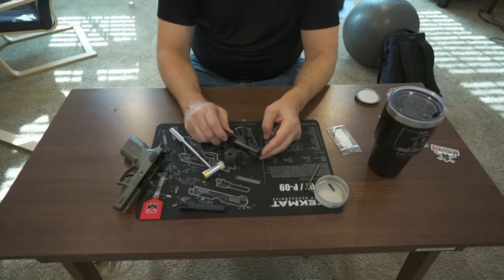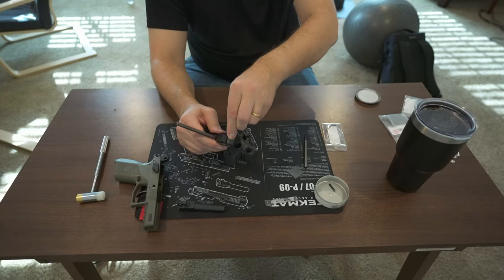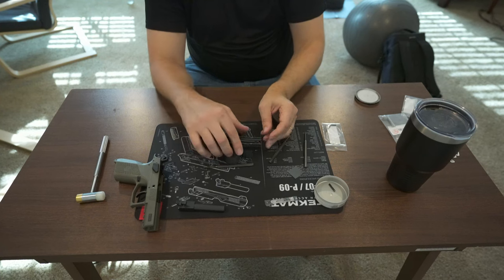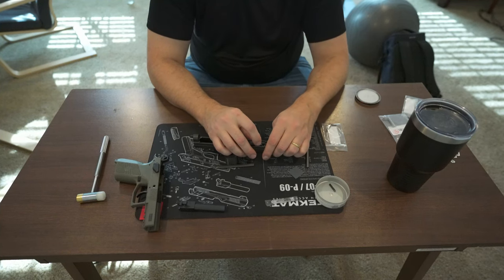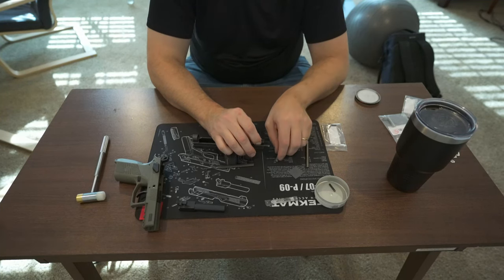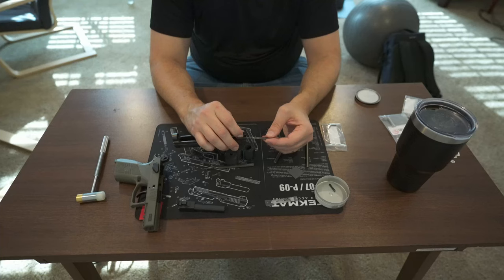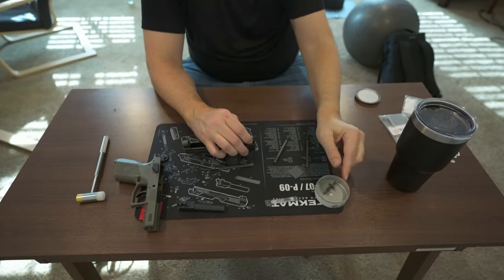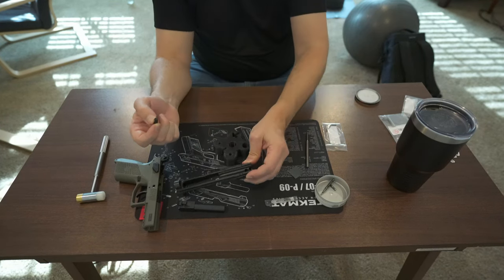Once I pull this punch out, I need a little wiggle room — I'm compressing the firing pin spring with the punch. Now we are at the second point, the point of no return. You have to maintain control of two different sprung parts: there's a spring for the firing pin block and a spring on the firing pin. I'm still depressing the firing pin plunger. Note the angle with which the firing pin comes out — those cool little grooves point up toward the top of the slide. You'll need to know that later.